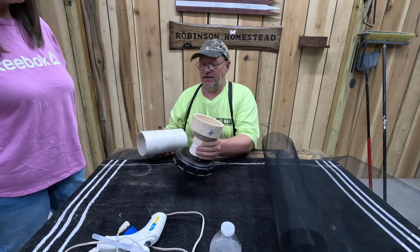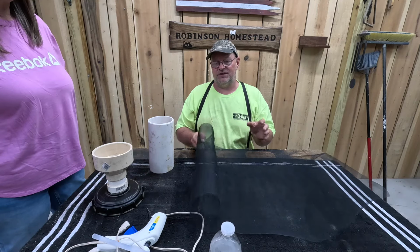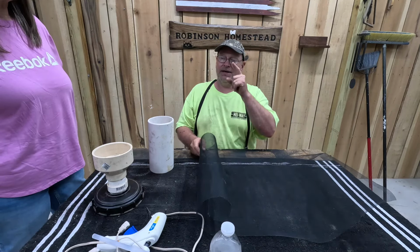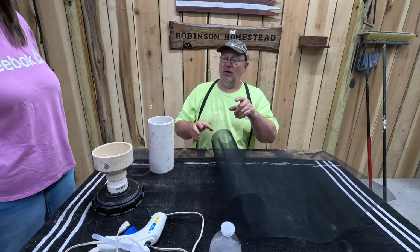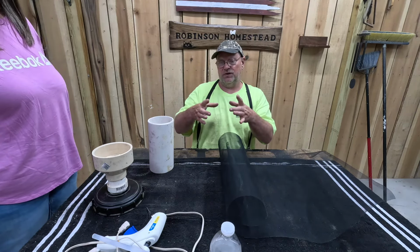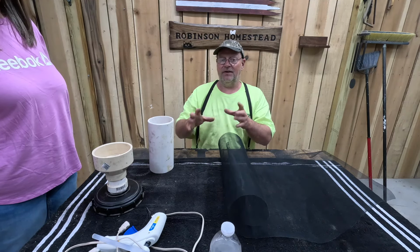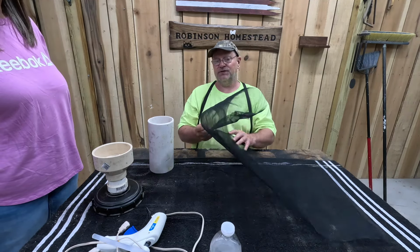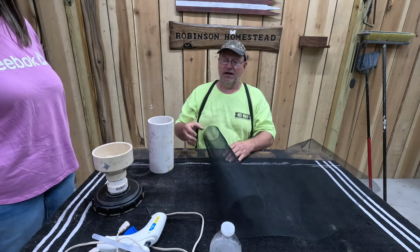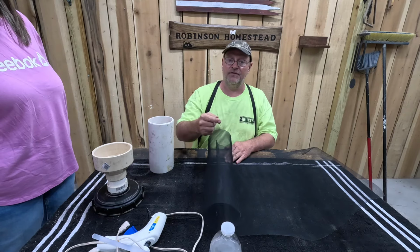And this is the second line of defense from garbage getting into our tank. On the gutters, I have a 1/4-inch mesh that covers the hole where it goes down, so we don't get any debris from there. That's the bigger stuff. This one's going to catch it a little bit smaller, and then once we get it into the building, there's going to be a paper filter.